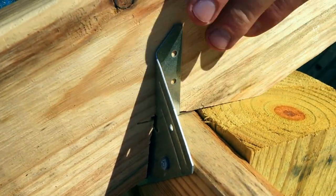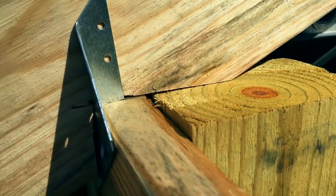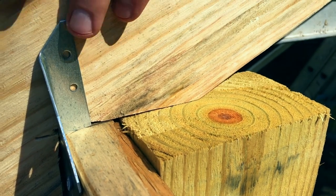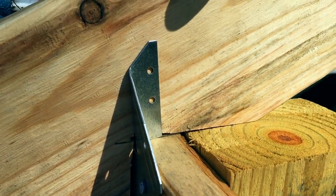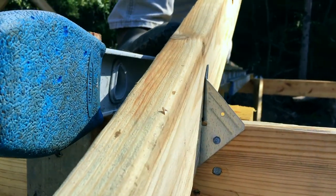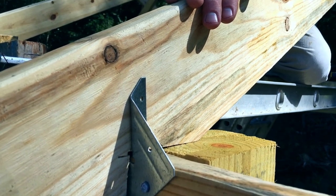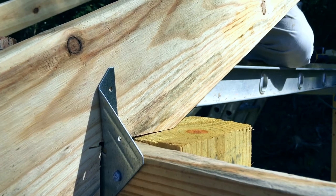This is why we did a four-inch cut on the bird's mouth where it sits — the rafter's sitting flat on the header board. Every other rafter actually sits on top of the post, so the four-inch cut extends beyond just the header board over onto the post, which is what I really want, so that the weight of the roof is being supported by the post itself. You don't want to do too much more than that because by code you can't cut beyond a third of the height of the rafter — that's because of structural integrity. If you go cutting too much into it, it's not going to support the load and you could actually break the rafter with too much load.